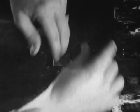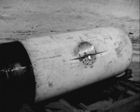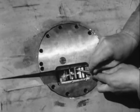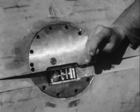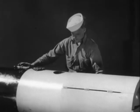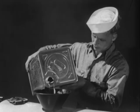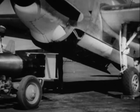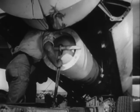This valve is secured with wire to prevent the air stream from springing it. Similarly, high speed and altitude make it necessary to prevent the impeller on the exploder mechanism from turning while in flight. A piece of .020 annealed soft copper wire is used. Impact with the water will shear the wire. At high altitudes and in cold climates, special precaution must be taken to ensure a sufficient amount of anti-freeze in the water chamber of the torpedo. BuOrd instructions should be followed. With the new modifications enforced, not only will the torpedo be more stable in the air and in the water with no appreciable broaching or hooking, but initial dives in 85% of cases will be no deeper than 50 feet if the proper entrance angle is used.